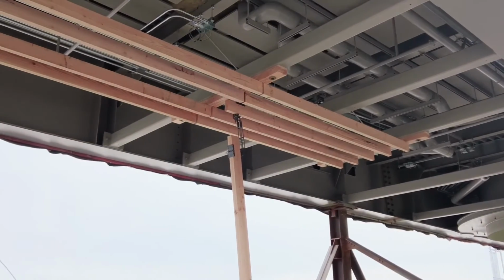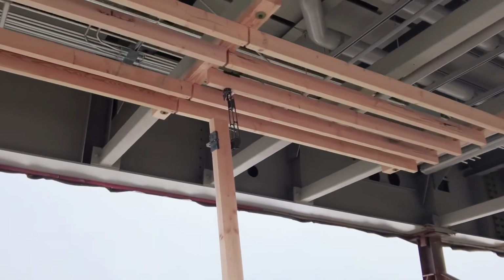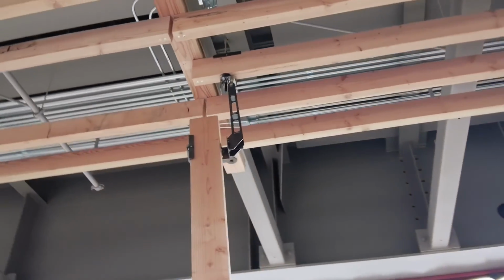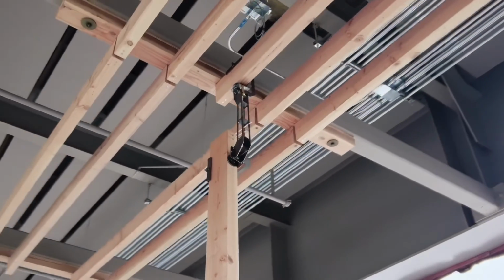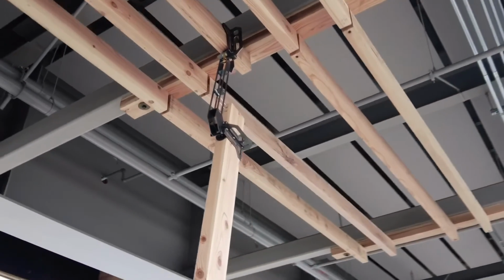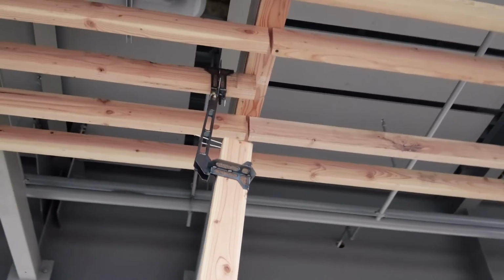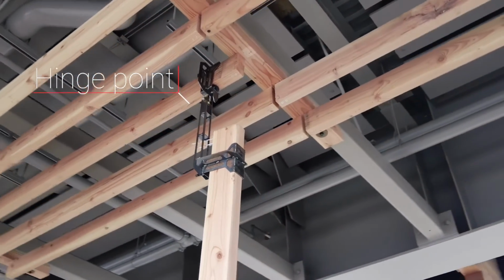What's the space between the lattices? Is that about a foot? A foot, yeah. So it's 2.5 by 5.5 inches, spaced 12 inches on center. And for the bigger lift, the bucket's probably half that size. The procedure is you could probably take the rope and throw it up and then tie it off.